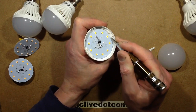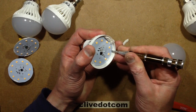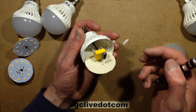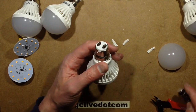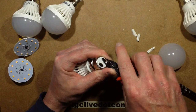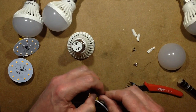To get the wires out the back, the circuit board itself won't fully pop out — it comes out to a degree but won't go further. At that point you can still access the board, cut wires or desolder components. But if you need to get the wires out, instead of being soldered in, they've got these little caps. If you get a pair of cheap snips and grip it by the side and just prise, these little rivets will come out and release the wire, and the whole lot drops out.